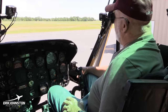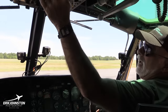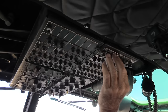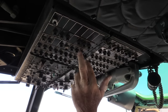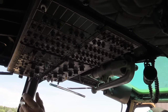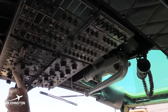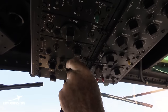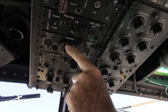Okay. Full pre-flight procedure, you'd come up and check all the switch positions that you have. Circuit breakers, we've got some non-essential breakers that we don't use in this helicopter, and they're all popped. You don't want electricity going to them if you're not really using that item. This is lighting, cockpit lighting and whatnot. This is a bleed air heater on, and then a rotating switch on that.